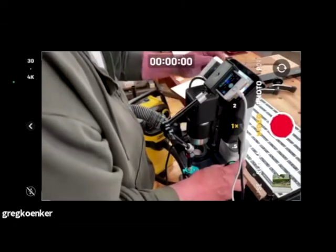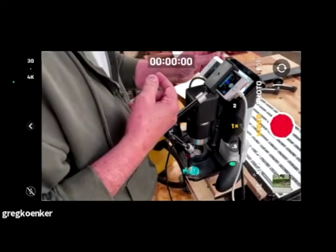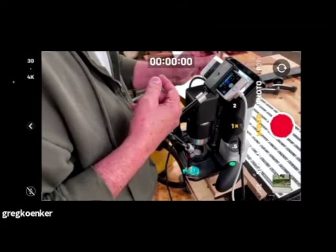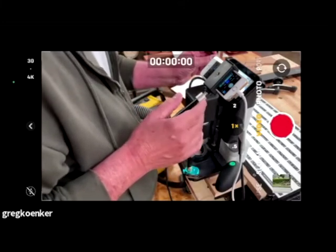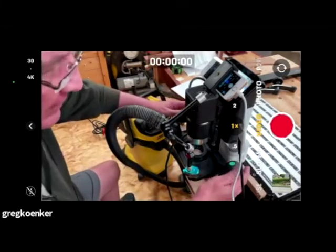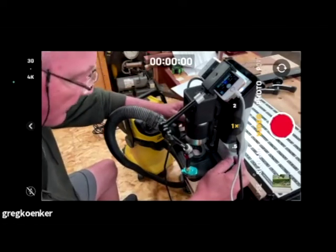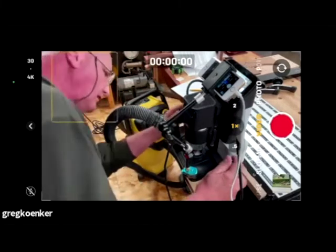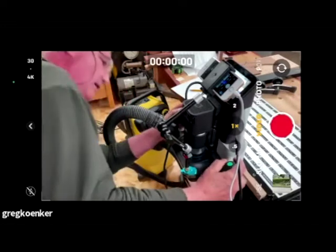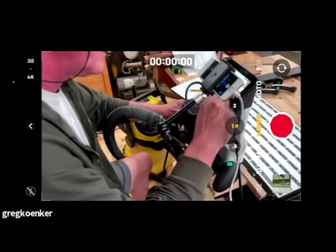And I'm telling it that I've got a 1/4 inch bit in it, right? That's what that is, 1/4 inch bit. And I'm telling it that I want a 1/2 inch grid. So a 1/2 inch between the lines on the grid. So now I'm going to go ahead and set the depth. And all I'm going to do is hit the lower button and the raise button. I'm going to hit the 2 buttons until I get it down where I want it. And I'm just going to duck down so I can see here. So there I am. I got the right height. I'll go ahead and say set depth.